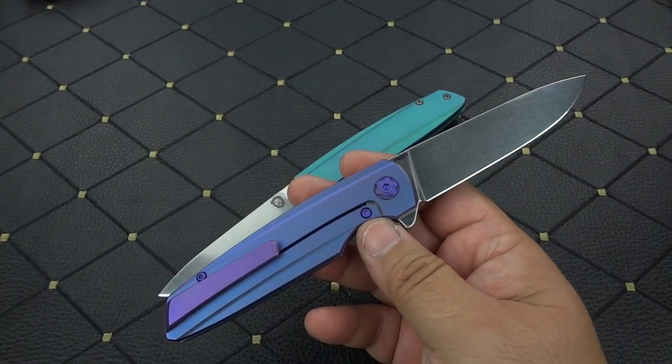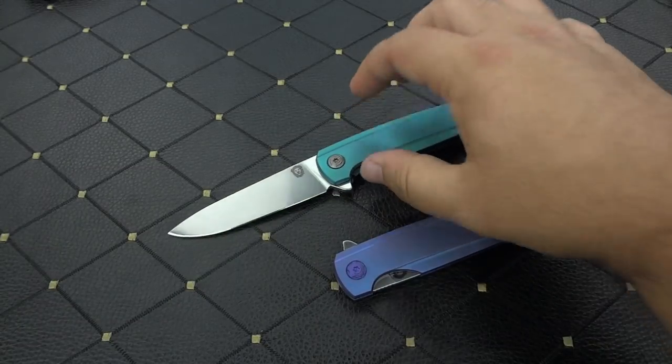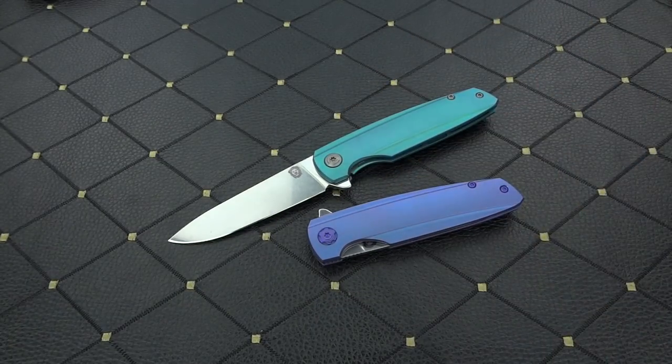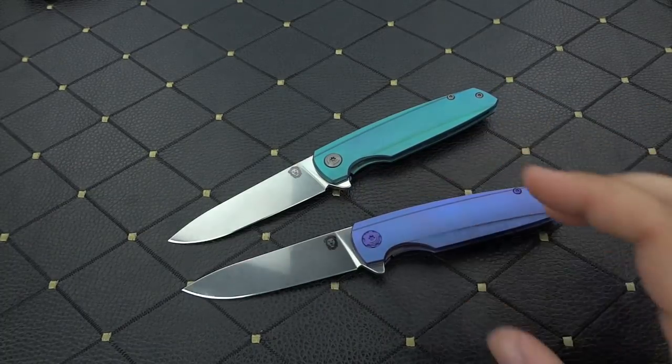And honestly, there's nothing wrong with sending out for your heat treat if it's going to a place like Peters or Bos or something like that. So they're using the best. I've used Peters a lot for my heat treat because they are the best. They are consistent, and they're all going to be tested. Every single blade you get back is going to have that little dimple in there. It was tested for its Rockwell hardness. So it's not a mystery. You know what you've gotten as a maker.